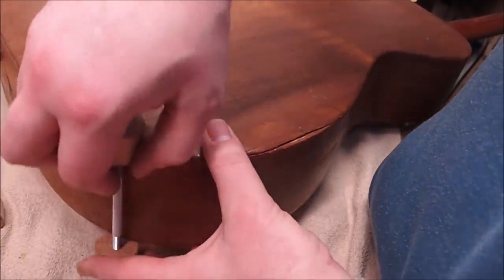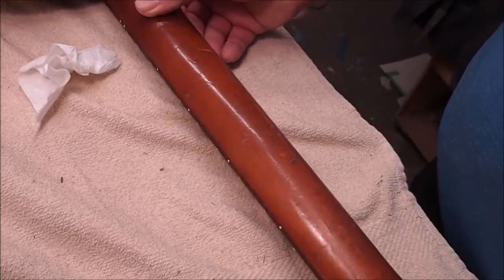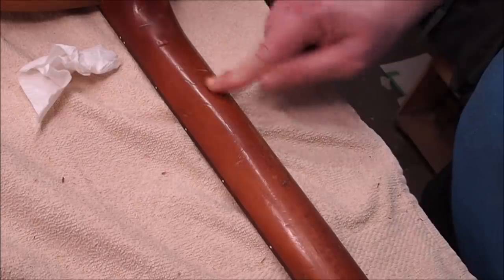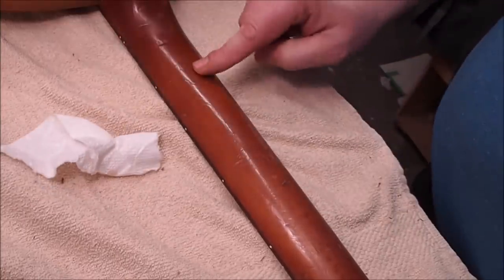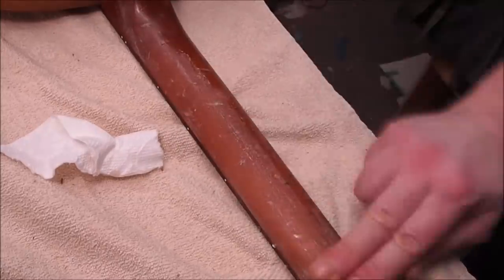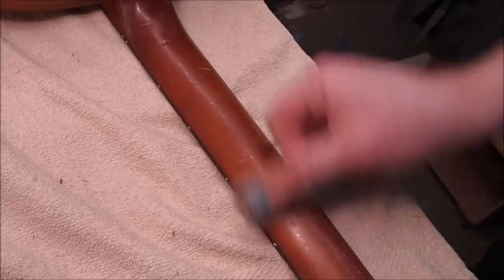Have to be quick with hide glue - I've only got about a minute to get the clamps on. This neck has definitely seen better days; it was obviously stored without a case and leaned up against any number of tables, chairs, or sharp angles over the years. There's a patina over the entire surface that's kind of mottled. There are also a couple of really egregious gouges - this one seems relatively fresh, this one is old and pretty deep but has accumulated grunge which softens the outline. Definitely have to fill those, and I'm going to lightly sand the entire back of the neck.